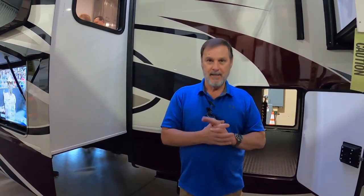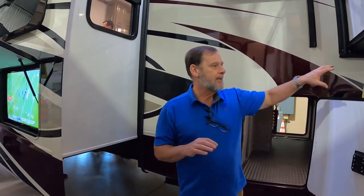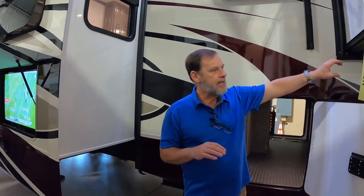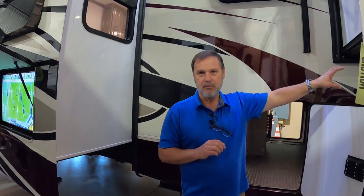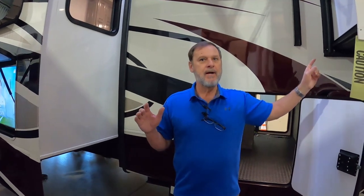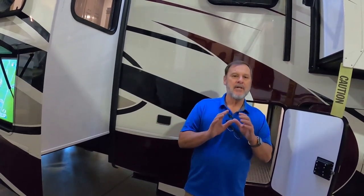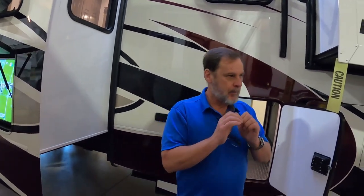Can you talk to me about tongue pin weight, balance, how do we find out the pin weight on this unit? The pin weight on these units — we try to keep it around 2,800 to 3,000 pounds. We don't want to overload the truck. The way we accomplish that is when you build the first one, you place your axles on the frame. Then when you do the weigh-up after the unit is built, if it's heavy, we have the luxury of moving those axles back and forth on the second unit to give us the balance required to make this thing pull so smoothly. We can pin weights right where we want them.